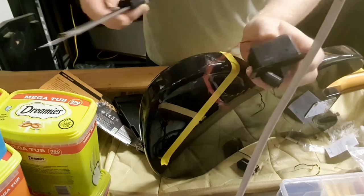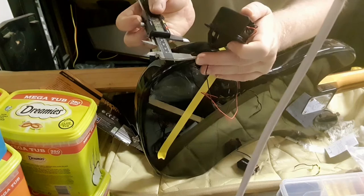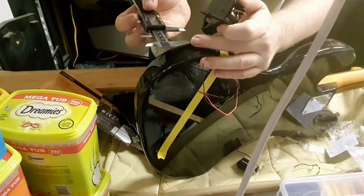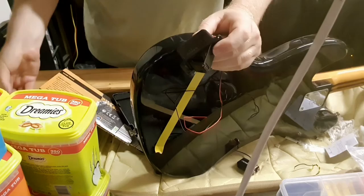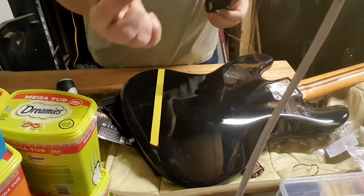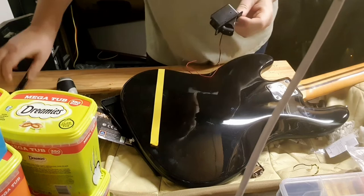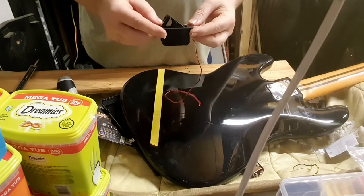I had to put a new battery in my vernier calipers. The distance there is just about 33mm roughly. When I open that jaw distance it's tight - coming from that angle back it is deep enough to fit the battery box, but there's not a lot of space behind it - only about six mil or so near the front. So as I make this cavity I've got to be careful not to go too far down. Drill bits with a spiky pilot point take up extra space, so if you try to set depth manually you could go straight through the other side.